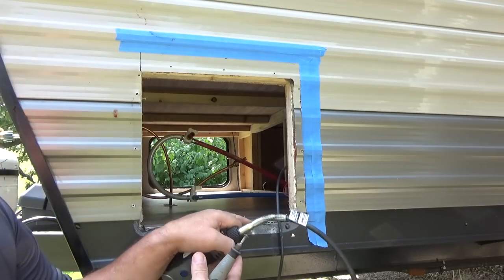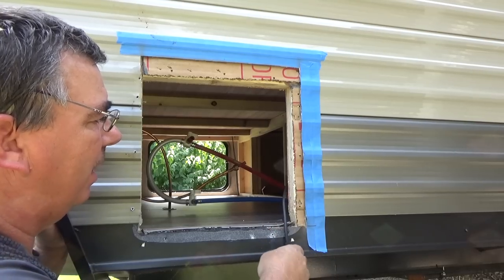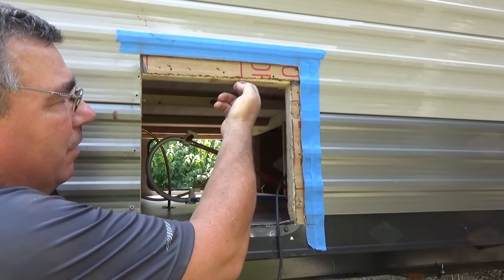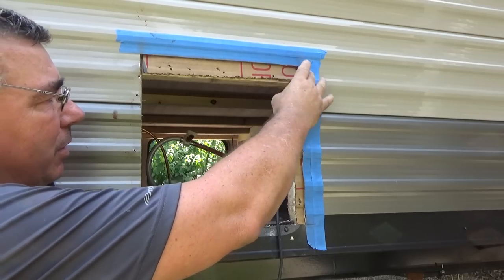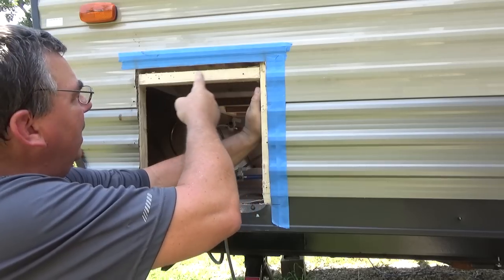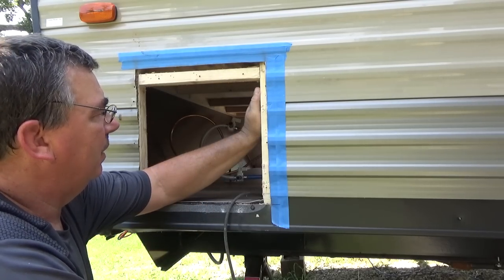Time to change my cutting wheel. I've got my aluminum siding trimmed out all the way, so now I just need to take the saw and cut these two-by-twos out. I'll put them back in and screw them on from the inside, and when I put the cover on, that will hold the metal to the two-by-two and everything will be in place. I'm going to take the sawzall and cut through these — they're more like one-by-twos. This one's already cut on both ends. I'll cut right through them, and then we can put these same boards back in there.